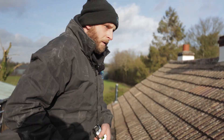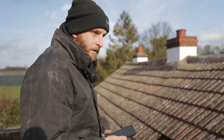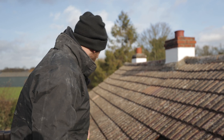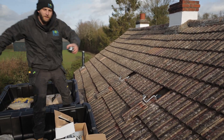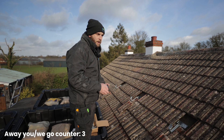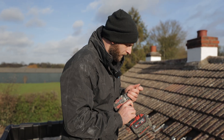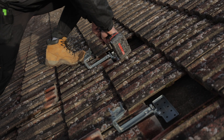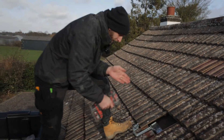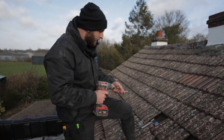So the panels are 1135mm. 1135 times 4 is 4540, plus 100 mil, so 4.6 metres. So that's that end there, and then we repeat it on the row above and away we go. He's a brave man up there — definitely windy. Nice and tight, we stick two of these in just to make sure we're solid. Making sure we go straight through the rafter, not on an angle so it pokes out of the side and doesn't get the full strength. Nice and straight.